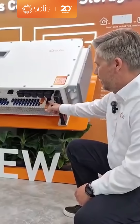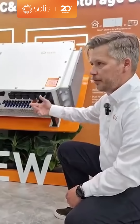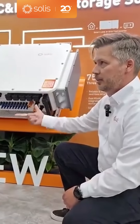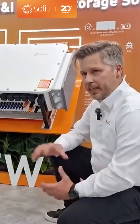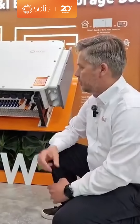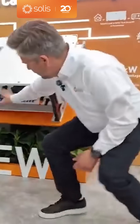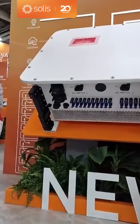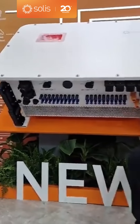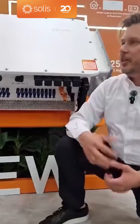You could either choose to have a battery for each port, or you could have one battery for both — that means you need to set up the system with a single BMS dual DC. Beside those, you have the MPPTs. We have 10 of them, each with two strings. Each string has 21 amps, so they will support the new big panels that we see. You have two DC switches. Beside there, you have the communication ports, where you have two RS-485: one for communication with other units, and one for EMS companies that want to control the units.